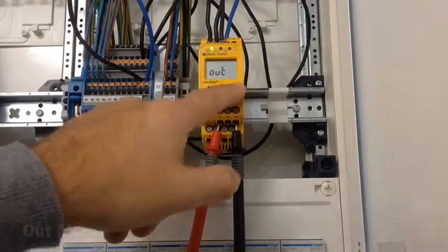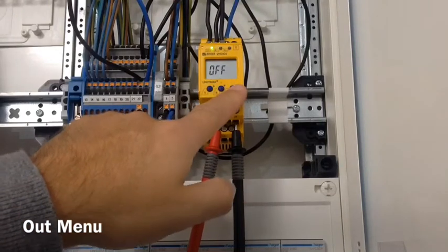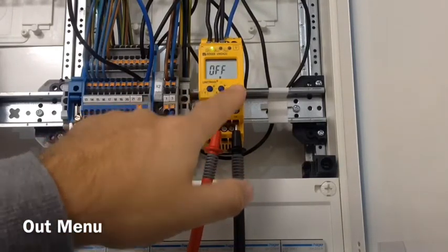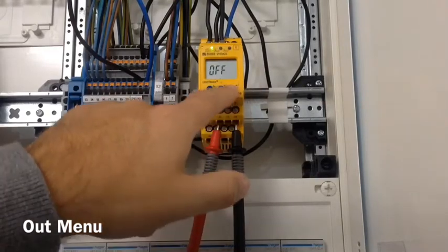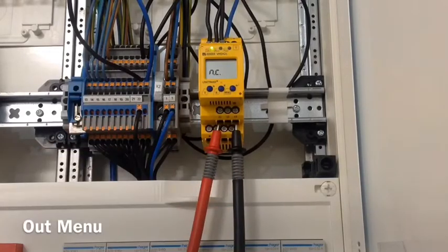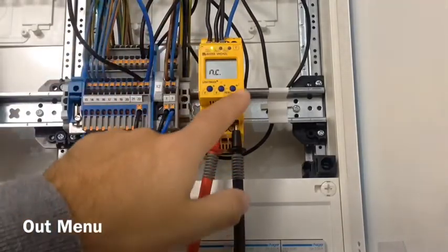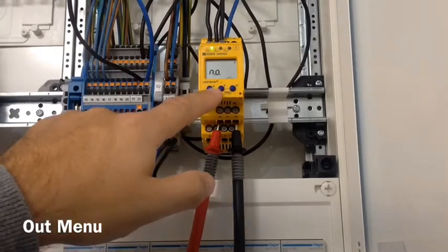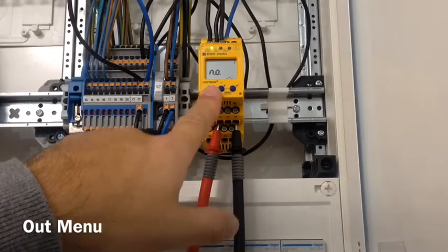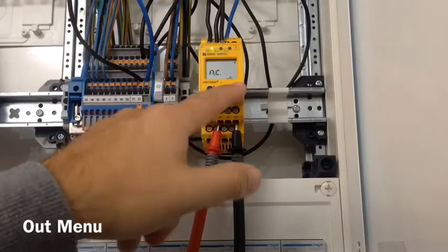Underneath the alarms, we can see the M is flashing — so the memory is off in our case, and that's how we want it. It could be continuous or on, but we want off. We can also change the relay contact type: normally closed can be changed to a normally open contact if we want — this is for K1. I don't want to change K1, but I will change Relay 2 to a normally closed contact — and you hear the click.